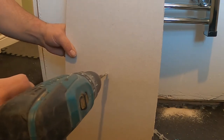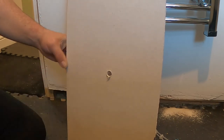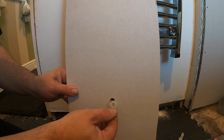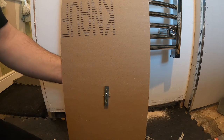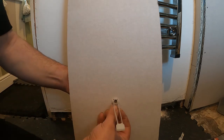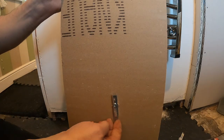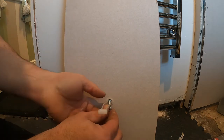Just showing you now on a piece of plasterboard - you can see it from behind in there. Just drilling the hole, just pushing it through until it drops. You can see it now from the back - till it drops, pull it tight, push the washer in to secure it. I'm not going to snip this one off because I'm just demonstrating. Put whatever you want through it, whether it's a bracket or anything - put that through your bolt, put that into the fixing.